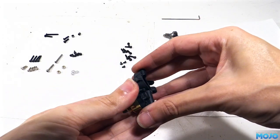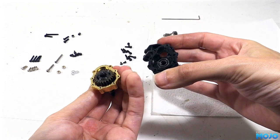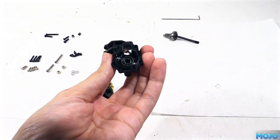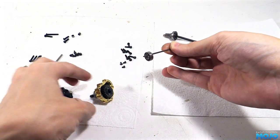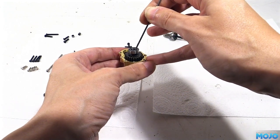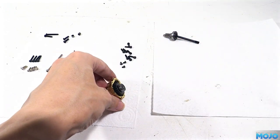Next we can separate the brass cover and the plastic inner. They might need some jiggling to get them apart, but don't be tempted to stick a screwdriver in there and pry them — just jiggle until they separate. If the remaining bearing in the plastic hub doesn't come out by itself, you'll need to fish it out. It's not a tight fit, so lift it out with whatever tools you have handy. Drop it straight onto the stub on the larger gear on the outer cover, so it's ready to go back together.